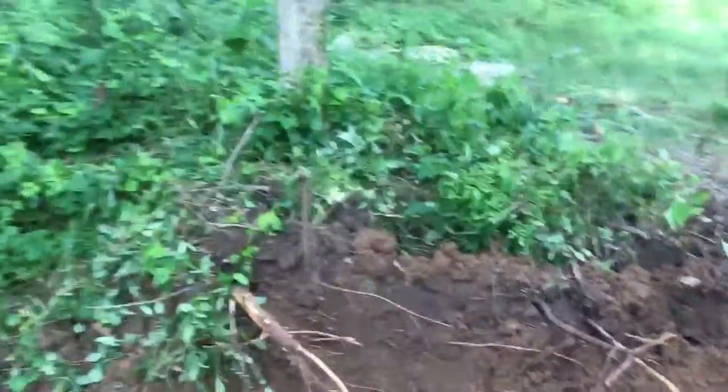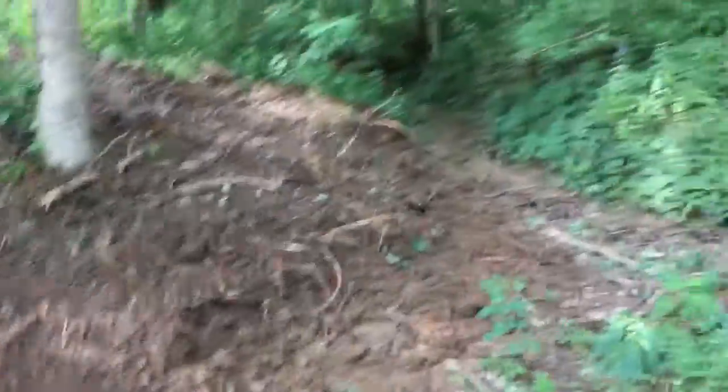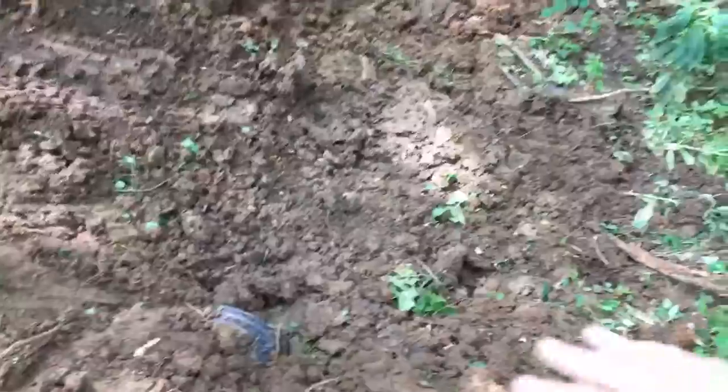I had to dig this little bit of bank. I'm planning on getting to doze that tree out here in about five minutes - it's gonna disappear so I can knock that heel down and kind of blend this back in a little bit, just let the weeds take back over. I did straighten this out so that when the water comes, it comes out real wide and then goes down to the culvert. I got the culvert up a little bit so it'll flow right into it. You seen those the other day - I made sure to tamp the sides of it down.